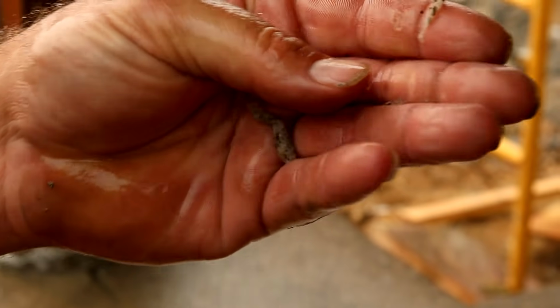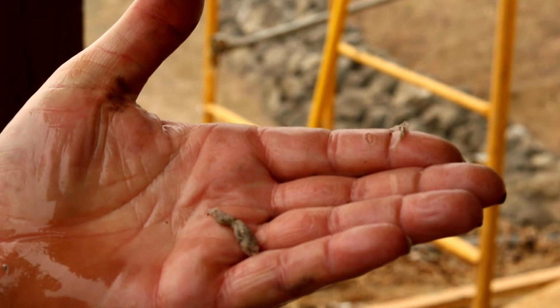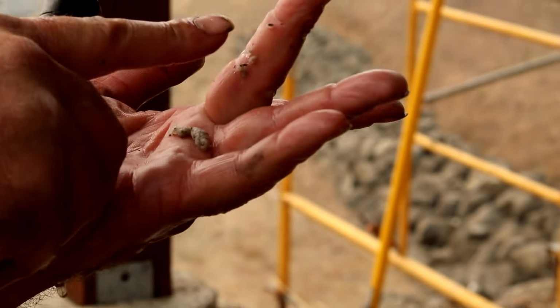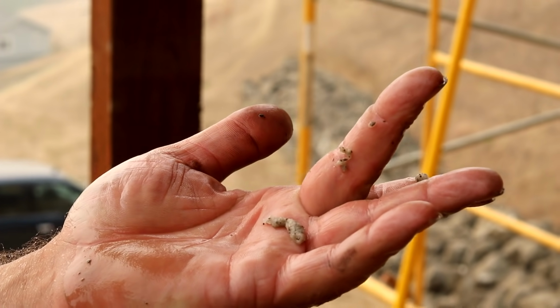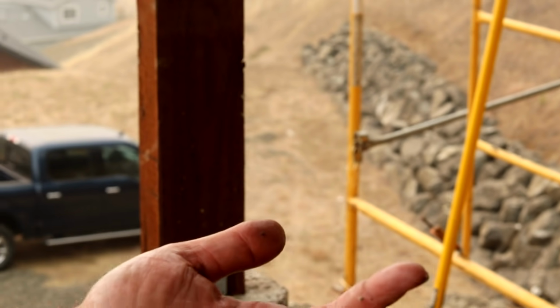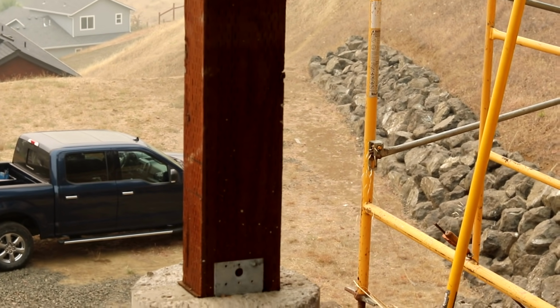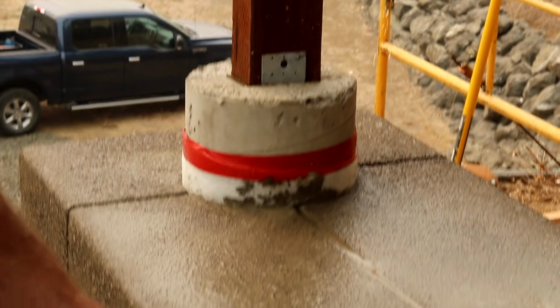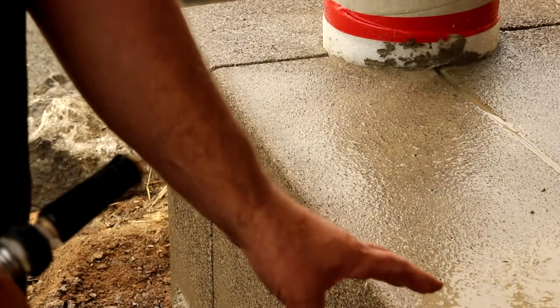So it's cut and then it's stretched. And the byproduct of that is there's a negative static electrical charge and the water will bead to it. So while the concrete's hydrating, this is going to help by keeping moisture for a longer period of time. Another byproduct for what we're doing is it doesn't add a tremendous amount, but it does give some more interlock on the aggregate. So when we're peeling the face, we can actually peel it and finish it just a fraction sooner.